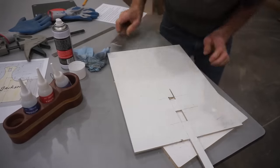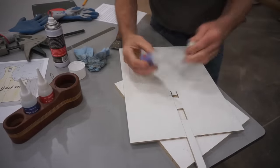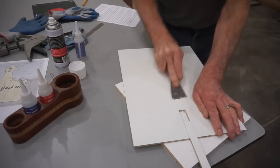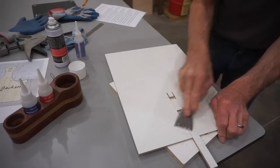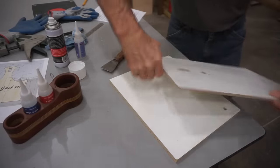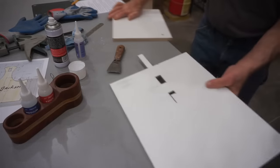And after a few seconds of curing time, I can pop the template piece loose and scrape away any excess CA glue from the surface for a nice smooth template. Then I repeat the application and wicking process on the back side of the piece and scrape away excess CA just to make sure these pieces are held firmly in place for the duration.